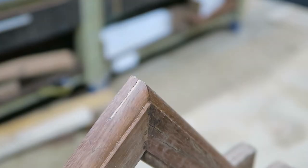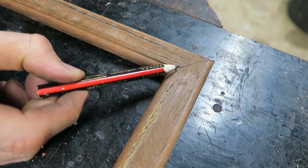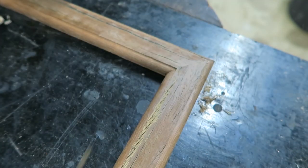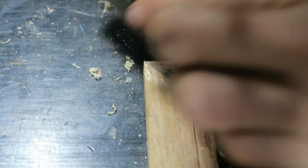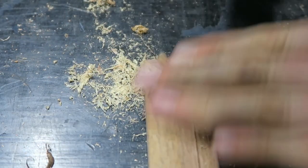And the final finishing can now start. Some edges of the frame sit slightly proud, so these get cleaned up with a sharp chisel. Then the corners are checked, and any that aren't completely flush are cleaned up with scrapers and planes. So with everything ready for finish and fit-off, I'll let the montage do the talking.